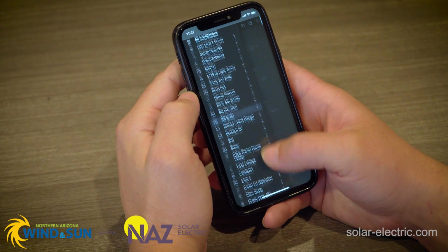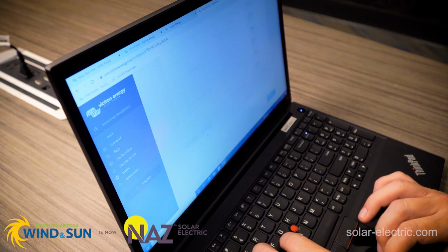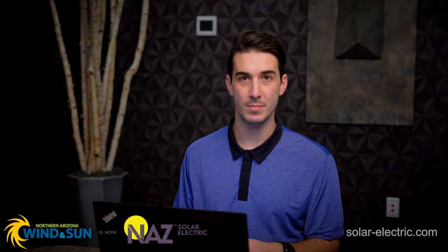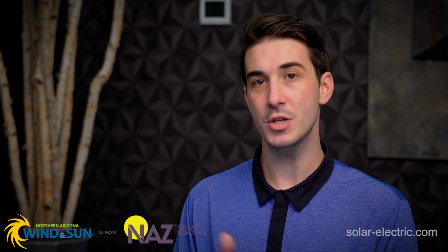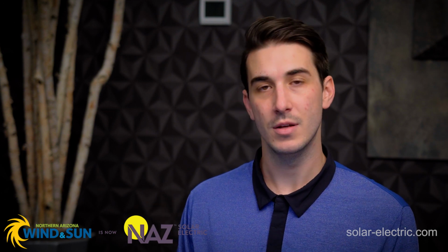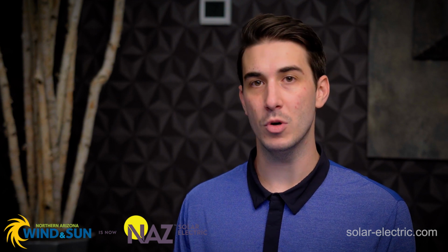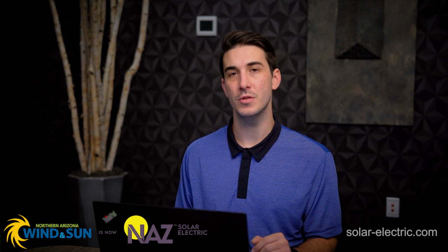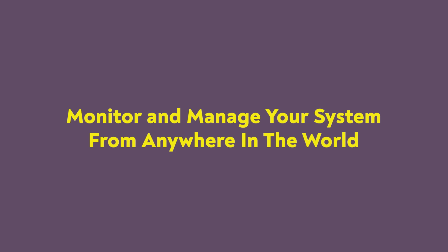So the VRM site can be used either on a mobile device or a computer. What I'm going to show you in this video today is the features and capabilities on the VRM using a laptop. One of the requirements to view your equipment on the VRM, in addition to having the GX device as part of your system, is that the GX device does require a connection to the internet. That can be either Wi-Fi, Ethernet, it could be a cell phone mobile hotspot. What's great about the VRM is it's a free site. There's no subscription fees or any kind of service charges.